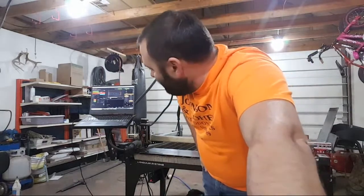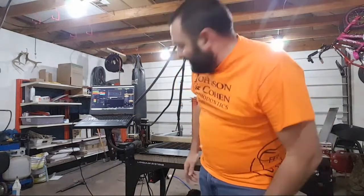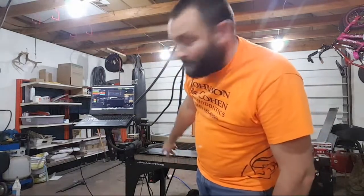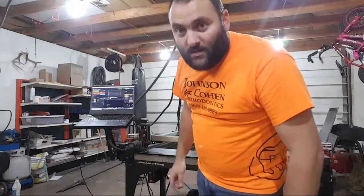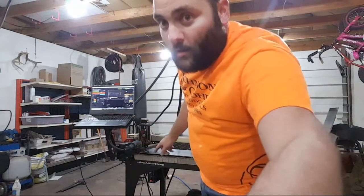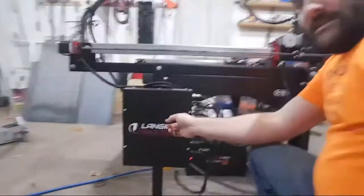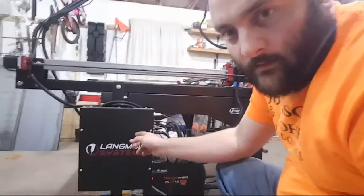Runs like that. Really powerful MacBook Pro too. Man, that's a bummer. I was hoping it was just me, and there was something that I could do to fix it. Look at that. It's still loading that program. Now, there have been times where I've turned off the drives below, and I feel like the program runs a lot faster. And the only thing that could cause that is if there's electromagnetic interference inside their control cabinet. Which, by the way, when I first got this, one of the screws had fallen out of the power supply, and so I had to take this cover off.